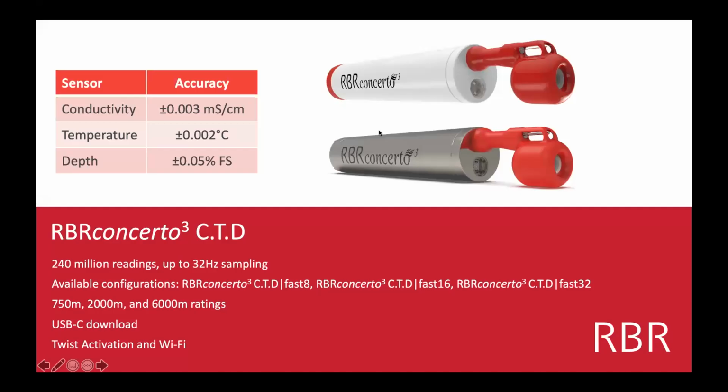Okay, thank you. So the Concerto CTD, as we mentioned, both versions have 240 million readings on the memory, and they can all sample up to 32 hertz. They have some configurations such as you can have them sample at fast 8 hertz, fast 16, or fast 32. They all have USB-C for direct download, and then they also can be downloaded through Wi-Fi as well.